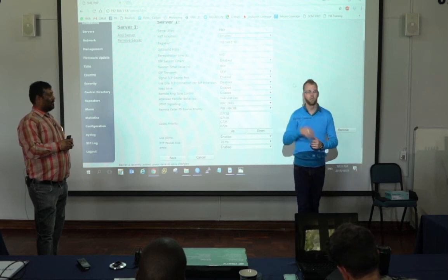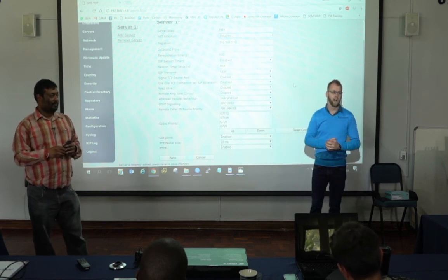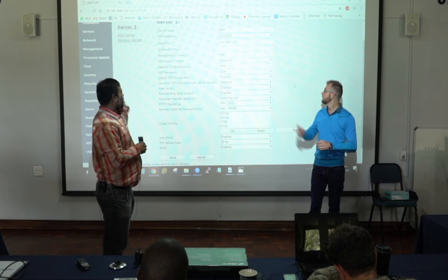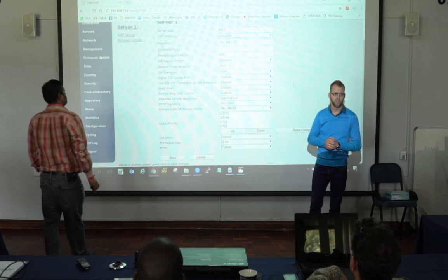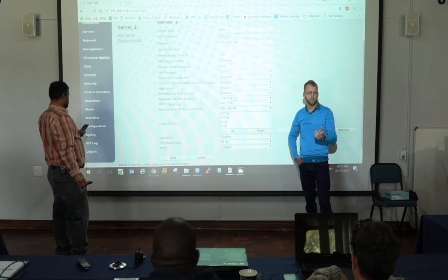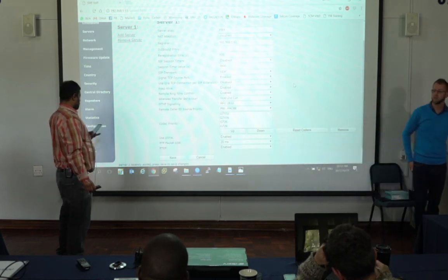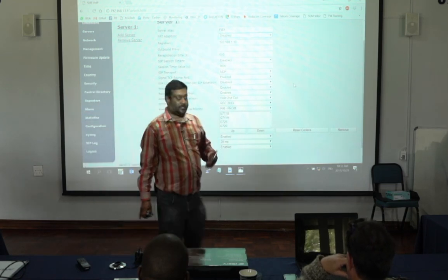For argument's sake, 192.168.1.234, and the PABX IP address. We've got multiple PABXs out in the cloud that we use for setups. We've got about seven that we use. So it can be any one of those seven IPs, which we'll give to you if you need to reconfigure one yourself. So for the hosted solution, the registrar will be a domain name that we'll give to you, and the IP address we'll give to you. On an on-site solution, it will just be the IP address of the PABX for the registrar.